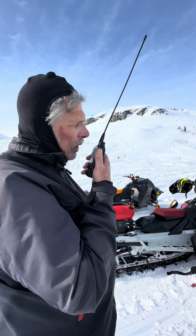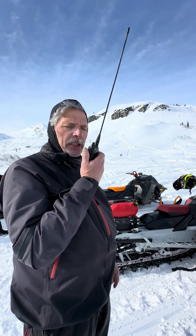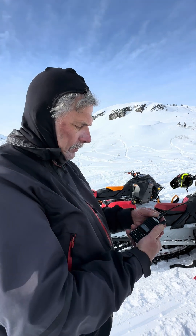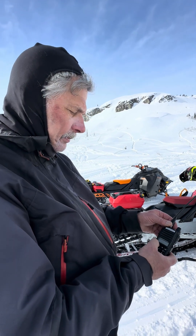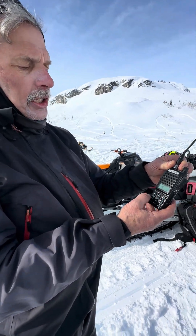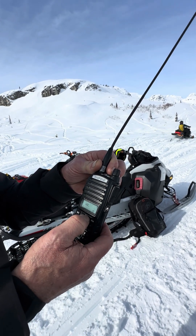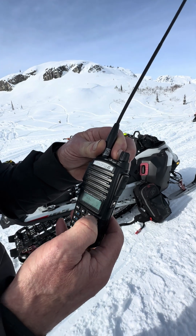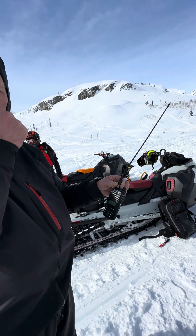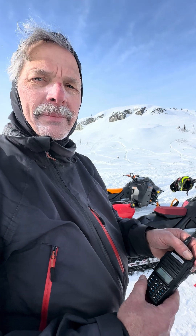You're on level one and I'm on level five and Dave's on level three. So we're going to change ours back to three, which is the default setting that I programmed. I'm going to set mine at three — menu, menu again, and just the down arrow keys, then menu again to confirm and exit. And then I'll lock my radio. Awesome — great tutorial on learning your Baofeng radio. If you need one, give me a shout.